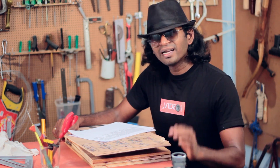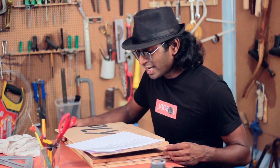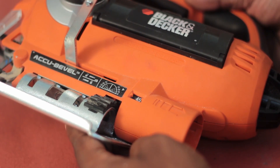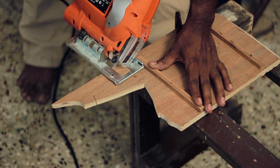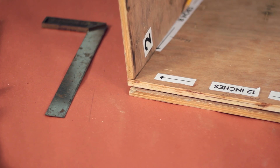This is done so that the tone of the Tappa could be adjusted later if required. I got these pieces pre-cut from the shop, and it's a good idea to share your plans with the sellers as they might give you pieces left over from their projects for a lesser price. One snag however is I want a miter joint on these pieces which I've never done before. The way I'm planning to do that is by tilting my jigsaw to a 45 degree angle and making my cuts. Let me do that with some test pieces first — practice is a must. After a bit of practice the results seem to be satisfying.